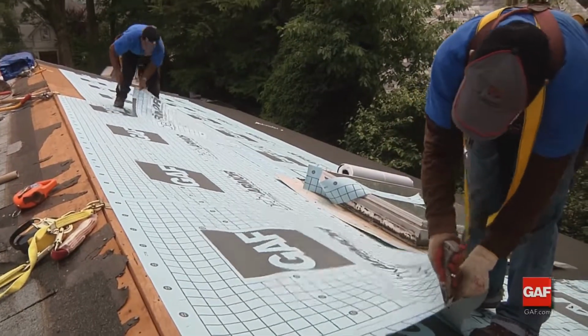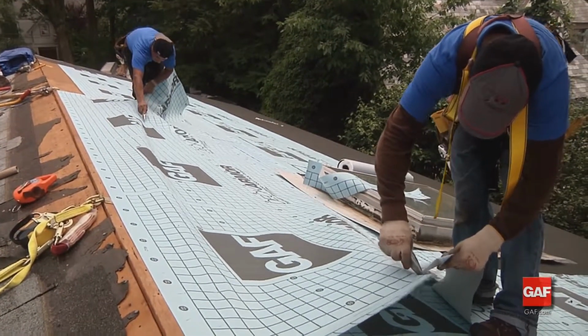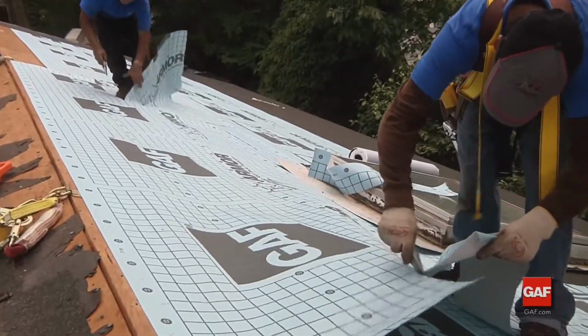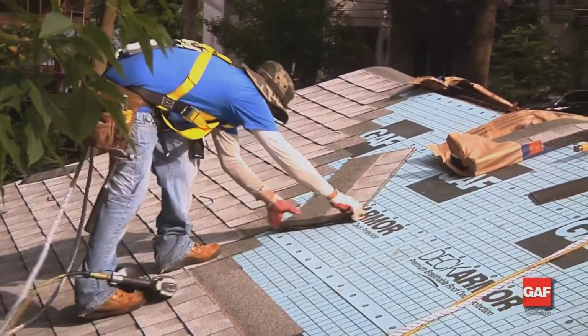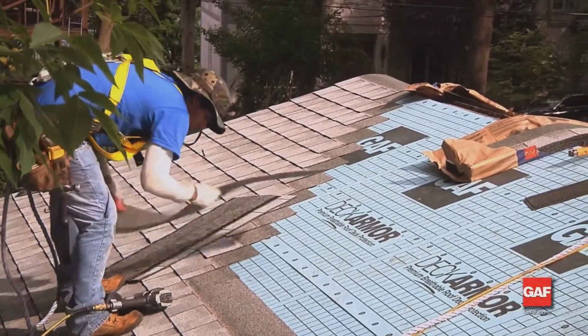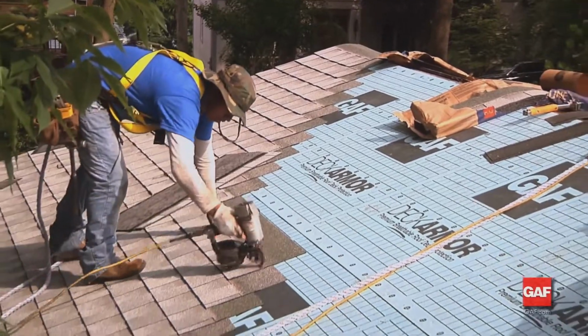In the unlikely event of a shingle blow-off, quality roof deck protection can provide short-term water resistance until more permanent repairs can be made. Quality roof deck protectors can also help shield the shingles from resin or other chemicals in the wooden deck that can attack asphalt and damage the shingles.